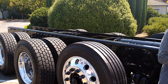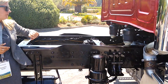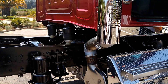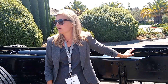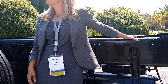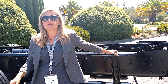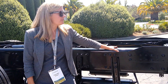This one has nice recto shaft clearance. It's an Allison 4500 RDS, and you can see the recto shaft off the engine — it's an X12 engine, which is new and currently available only from Daimler in this market. It is 600 pounds lighter depending on spec than their previous engine, which for a mixer is about an eighth of a yard of concrete. So if they're making 10 or 15 turns a day, it really starts to add up to a significant amount of weight savings.